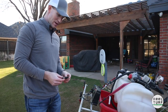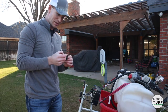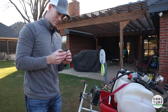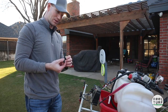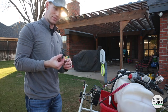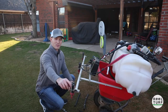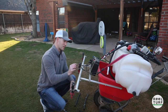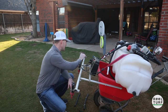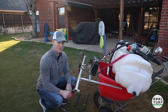One concern I had was whether this tee might be cracked from being cold, but it appears to still be okay. I'm doing the same check on all these nozzle bodies to make sure there are no cuts, cracks, or leaks in them — and everything feels and looks like it's still okay. So hopefully it's just the hoses.